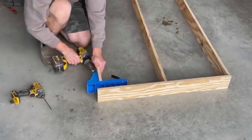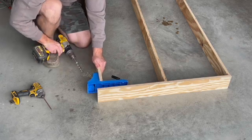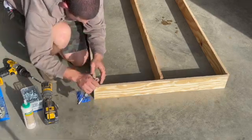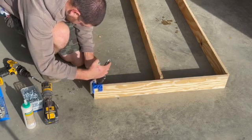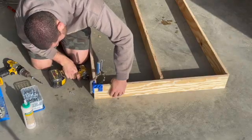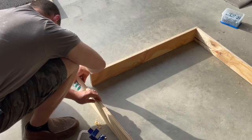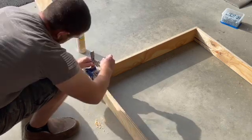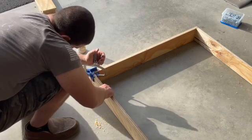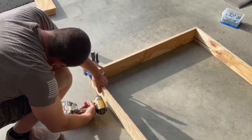As far as joining all these pieces together, we're going to use pocket holes and a little bit of glue. The glue I don't anticipate to really offer all that much strength but it'll help just tie everything together. This is one of the first times I've ever used pocket holes, and every video I watched suggested that you clamp your surfaces together — I found that to be true because I had a couple joints where they weren't clamped completely and the screws tended to strip out a little easier.